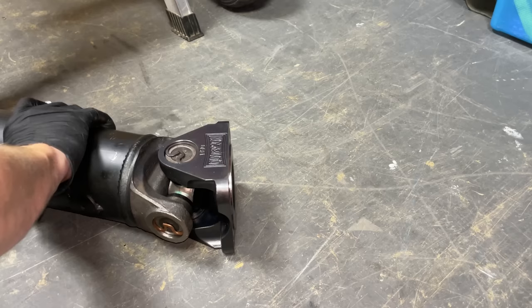We had a couple of leaks. So this union here was dripping coolant, and the way that I've done my breather system, when you're doing donuts or wheelies and moonwalks or whatever, oil can come out of here and it's going to come flooding out of the bottom here. So when we were doing that donut, that's actually what was happening. It lost quite a lot of oil. So I think I'm going to swap these over again and have this fit in on this side.